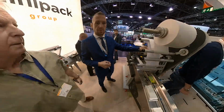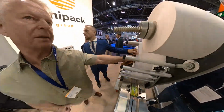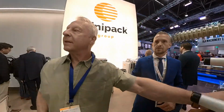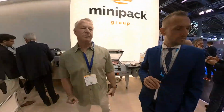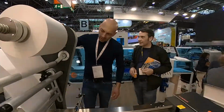No, it's 100% paper. Is this 100% paper, Beppe? Paper, yes. No, you can feel it, on one side there is a thin film. A vegetable glue is spread on it, which reactivates at the sealing. The glue is not plastic, it's a vegetable glue. Oh, okay, no plastic, glue. So it is paper with vegetable glue, and when the temperature of the sealing bar comes, the glue reactivates and seals.